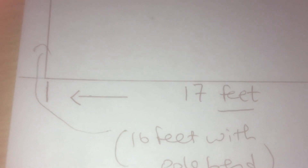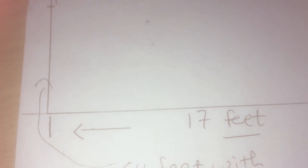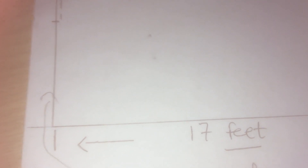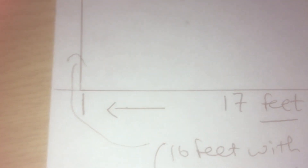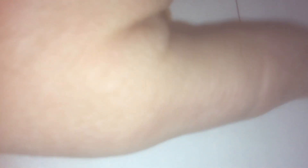Here's the rudimentary drawing — apologies for the poor lighting and working conditions with my phone. This is the doublet. At the bottom left you can see 17 feet — that's the left-hand leg. Across to the middle there, that's the center pole going up 30 feet to the apex. From the left-hand side to the middle I've got 17 feet to work with. I put the left-hand pole at 20 feet — all fiberglass poles. The wire runs from the apex and just droops down approximately six or seven feet.